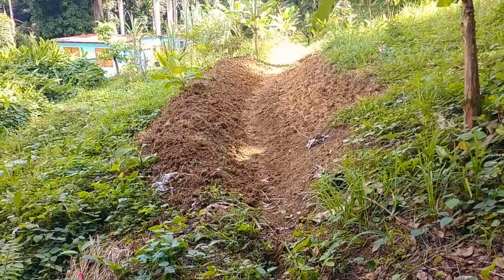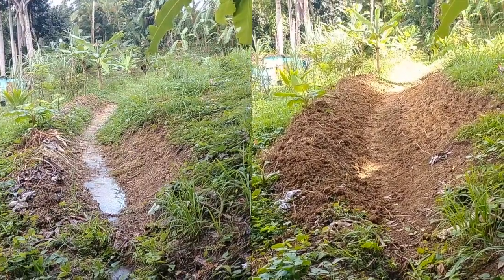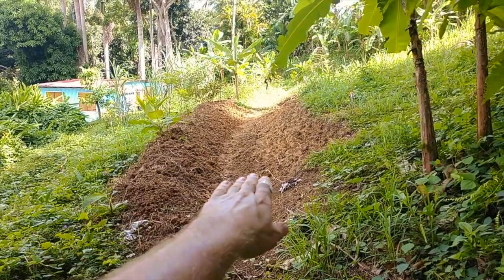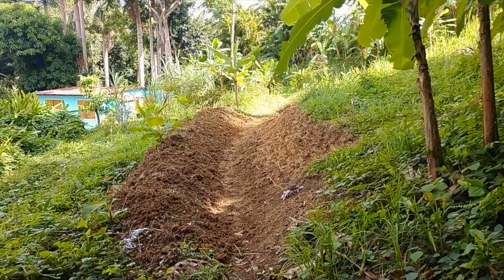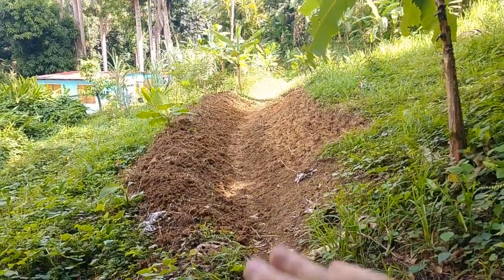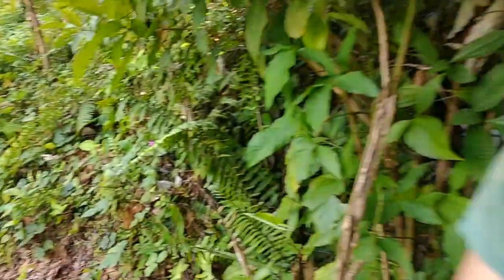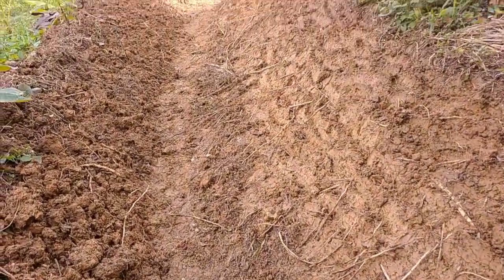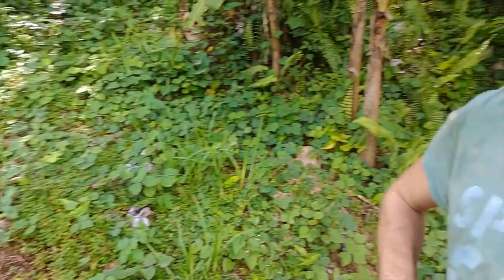Here's the work we did yesterday compared to before. We basically dug into the slope here and then dug away all this to create a small little bowl. It's a bowl-shaped swale that helps hold the water nice and passively. The base of the swale needs to be right on contour — level, or a very slight one percent grade going away if you want to direct the water a little bit. We spent a couple hours digging this out in super heavy clay, all by hand. Most swale installs use machines, but we're doing it poco a poco — a little by little.